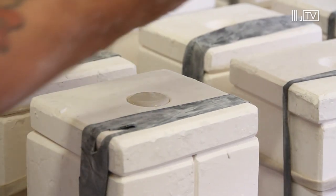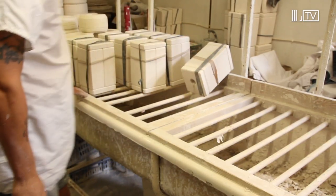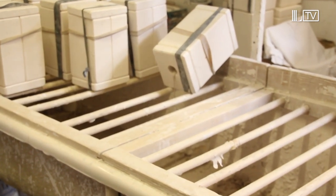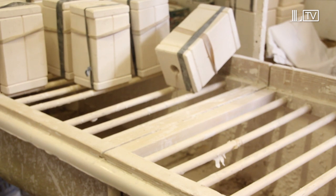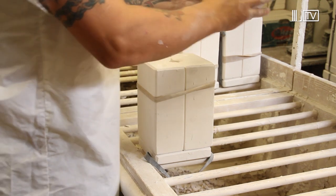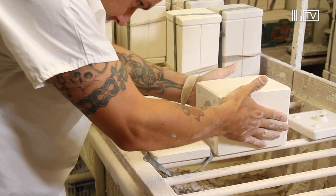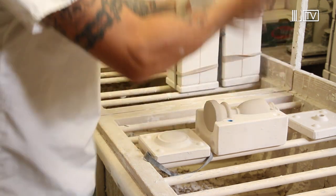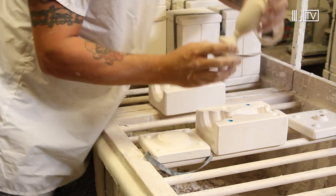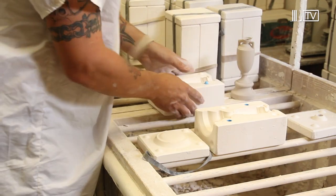It takes a few minutes per one. This will be tipped and left for half an hour once empty to dry out so you can remove it from the mould. Lee is now opening the mould up very carefully. There will be a slight moulding mark all the way around the edge, which will be removed with fettling and sponging.